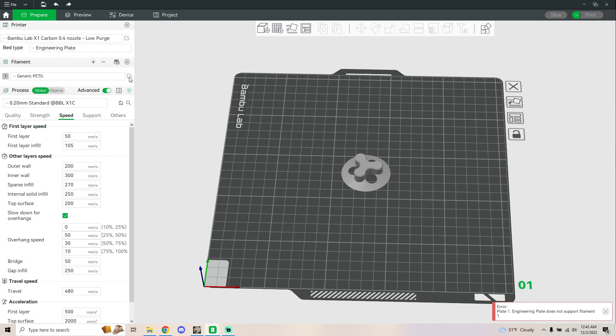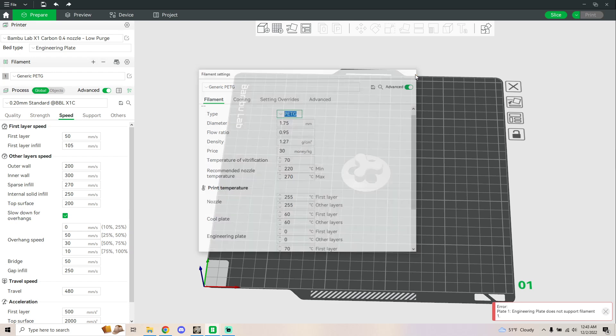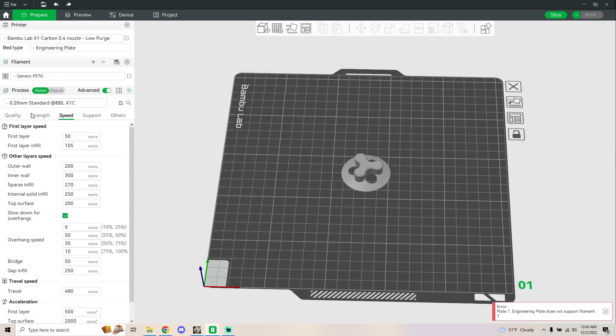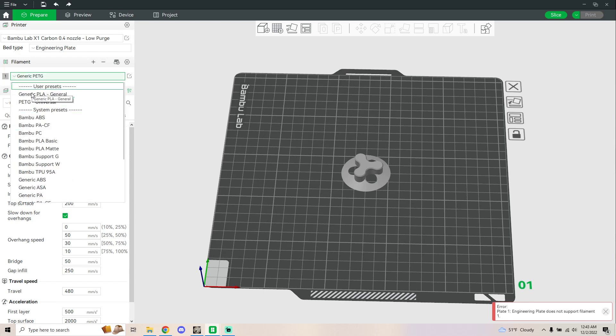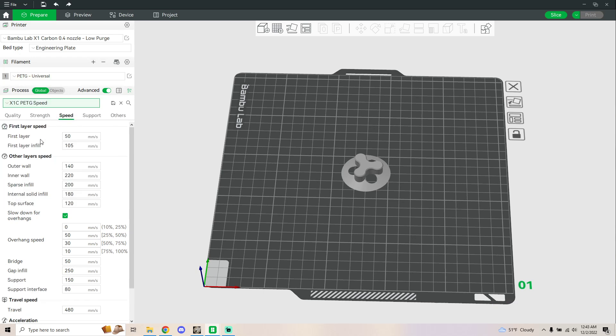The stock temperature was also very low — it could not keep up. So for it to be able to print fast, I had to bump the nozzle temperature up to 280 for its average temperature. But I also had to drop down the speed by quite a bit.